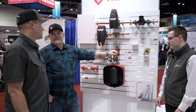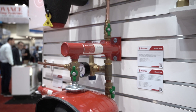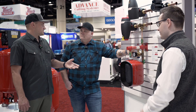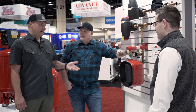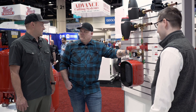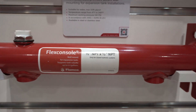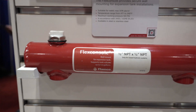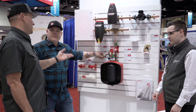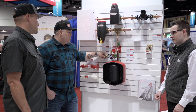What do you think about expansion tank brackets on systems? Every tank we install has got to get mounted one way or another. My inspectors anymore don't allow me to hang it off of piping — that's not acceptable. So it's going to get a bracket like the Flamco bracket or some other version of a wall bracket. And this setup here is pretty cool because it's kind of all in one kit — it makes it a really quick install.